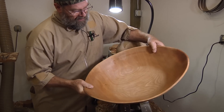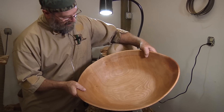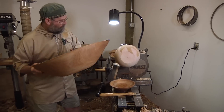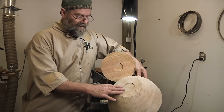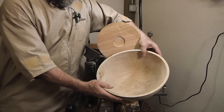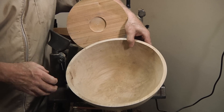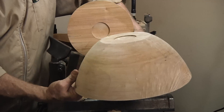It finished moving at about 25 by 17 inches. The more it warps, the better I like it — but that's another story. A recess of this size is plenty for turning a bowl this size; it's also plenty for reversing it and coring. I core just about everything, and the coring tools can put a little bit of extra stress on it, but it works just fine.